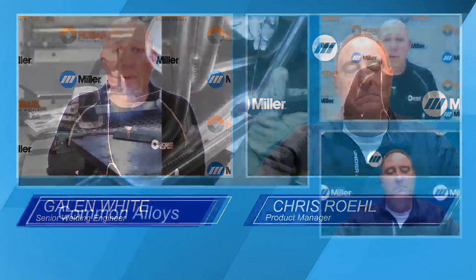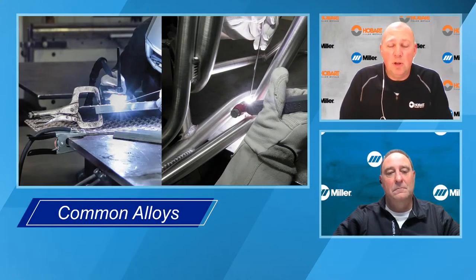The next most common base metal series that you'll see is a 5000 series. So a 5052 would probably be what I see the most in general manufacturing, in sheet or plate, but also you might see some 5005. When you start getting into more heavy boat building or ship building, you might start seeing more 5086 or 5083. Every once in a while, you'll see some diamond plate, which could be like 3003, or it could be 6061 also.